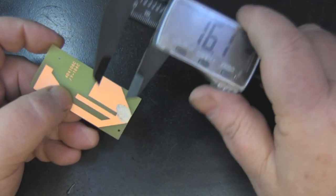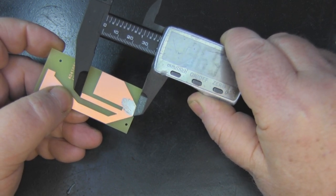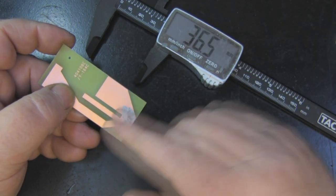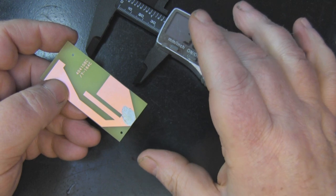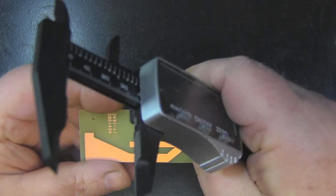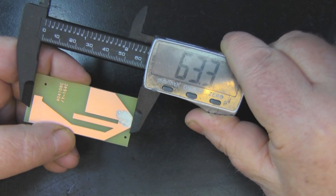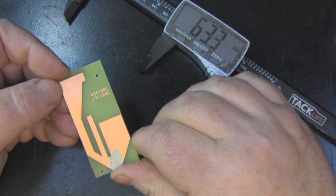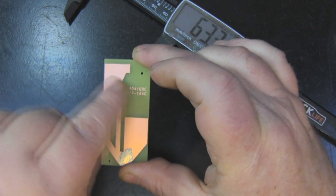The middle element measures approximately 36.5 mm long and does all the work in the 1700 MHz to 2170 MHz range. The final element, which has the most gain, measures around 63 mm and handles the 700 MHz to 960 MHz range. It has sufficient length for that wavelength and is tapered quite thick at the top for extra bandwidth.